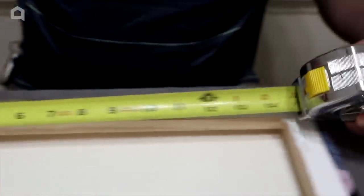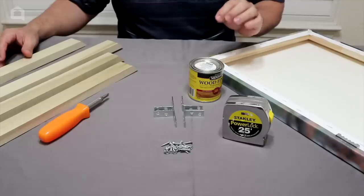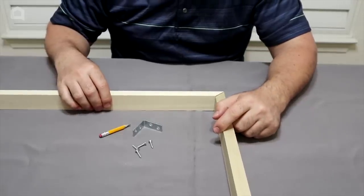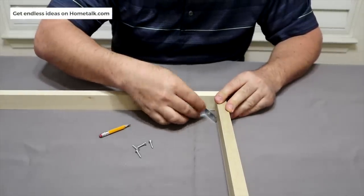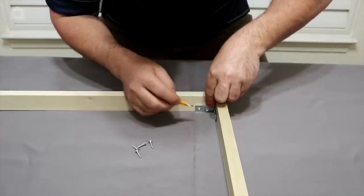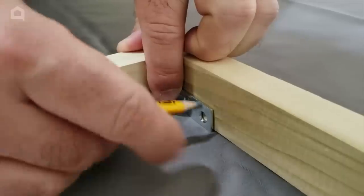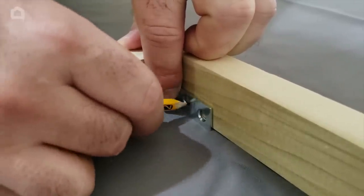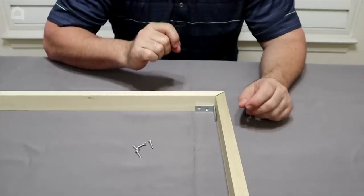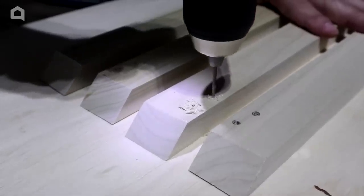When I measured the height of the picture it was 16 inches. Again, measure for the corner braces and add another quarter inch, so that frame would be 16 and a quarter inches. I've got my mitered cuts right here and I'm going to join those together, take the first corner brace, and set it at the bottom of the two pieces. Then mark these four holes. The reason we want to put it at the bottom is because when our canvas frame goes in here, you won't see them. Mark all four corners, then take a drill with a small drill bit and do a small pre-drill — that's going to help our screws go in. Do this on all four corners.